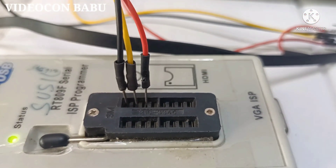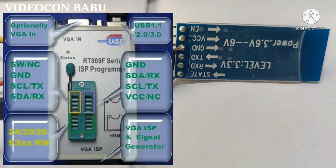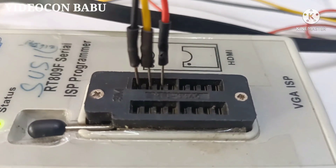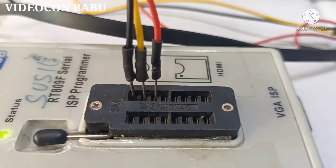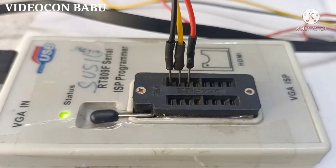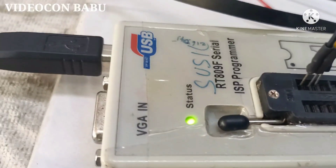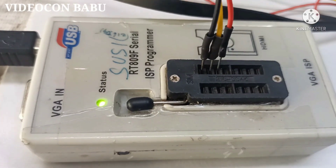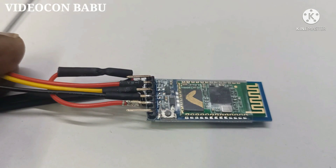The wiring diagram is shown in this short. This is the manner to connect the TTL device to the programmer, and normally we are connecting the programmer through a USB wire to a system or laptop. It is connected. Now I am going to connect the VCC through a power bank at about 5 volts.